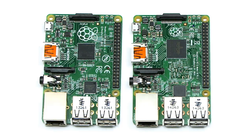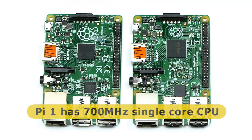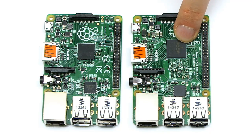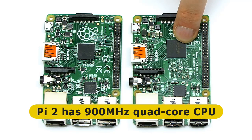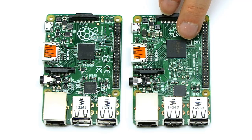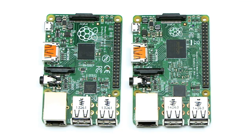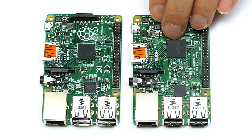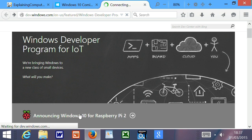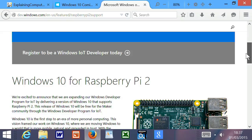But the most significant change is the processor. The processor on the Raspberry Pi 1 is actually underneath the memory, and it's a 700 megahertz single-core Broadcom BCM2835. Whereas on the Raspberry Pi 2, a slightly physically bigger chip that no longer has the memory on top of it, we've got a 900 megahertz quad-core processor — the BCM2836. One of the big differences is the Raspberry Pi 1 runs ARM instruction set 6, whereas the Raspberry Pi 2 runs ARM instruction set 7. That's very significant because it means you can run a much wider range of operating systems. Perhaps most significantly, later this year we're going to see a command line version of Windows 10 made available freely for download from Microsoft for the Raspberry Pi 2, which means you'll be able to get into all sorts of Internet of Things projects using Windows on your Pi. And that clearly is a fantastic development.